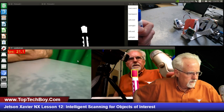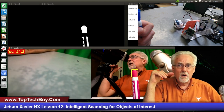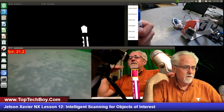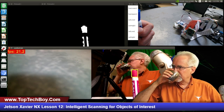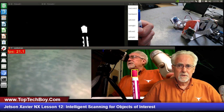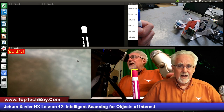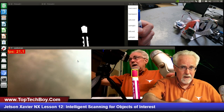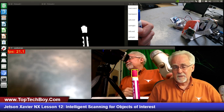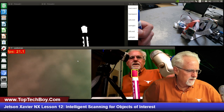I hope you can see in the camera view that it is making its way. You might even think about doing more than 10 degrees — the pan goes pretty fast but the tilt seems to be going kind of slow. I just want to let it go and see if it can find the pin. Boom, locked onto it! This went easy once I knew how to do it. But when I did it the first time, I was trying to use that trick of combining the if-statements for less than 1 or greater than 179 — but that doesn't work because you could get all the way to the right by tracking with the blue pin, and then your dpan isn't what you thought it was going to be. I had to break it out completely into separate if-statements to get it to work.